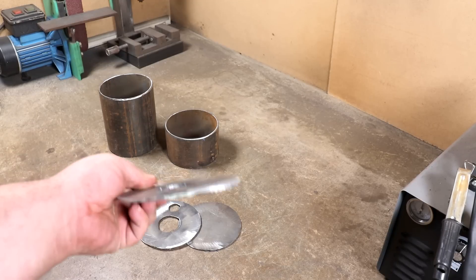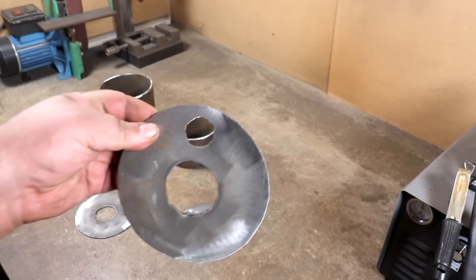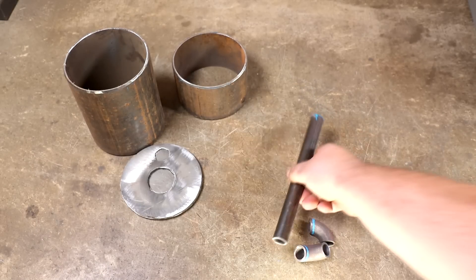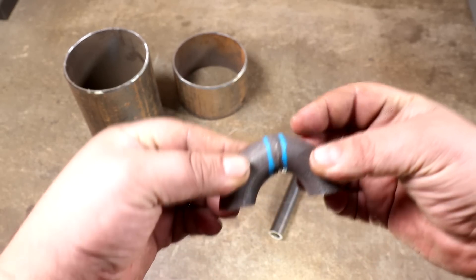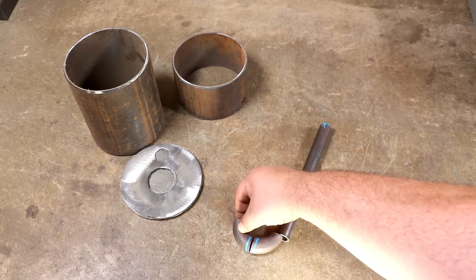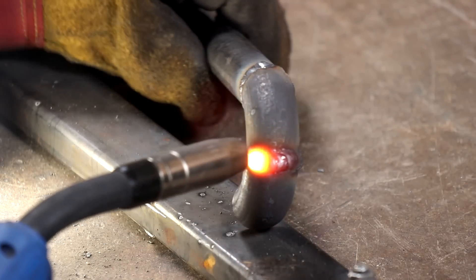Here's what happened: a lid with a hole in the middle, a lid with two holes, and a blind lid as the bottom. This pipe, one half inch, is just right for the little hole. For this part of the design I took two 90-degree turns from the store. I'll cut them and weld them together to make a full turn of steam. The flow will come from the small pipe. Unfortunately, this pipe I had was the smallest of the steel ones — I would certainly take thinner. There is an M6 thread and it fits perfectly with the M6 coupling, which I will then weld onto the end of the pipe.